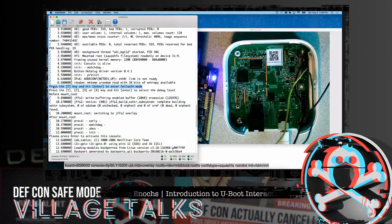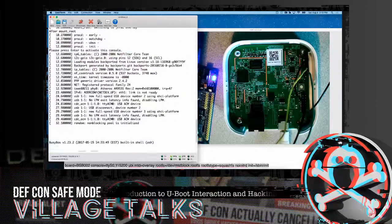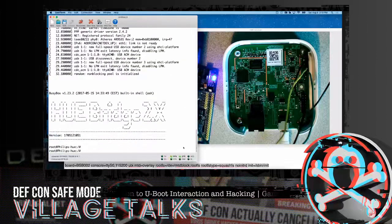From the Luma, just out of curiosity, I was working to try to get data off of it. The way I originally did it was go into the F mode and manually, not totally manually, but very close to manually, reconstruct the device nodes, naming them all the correct pieces and parts to build a USB. And then from there I was able to move the data off to the USB. Just some stuff to think about.